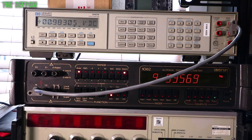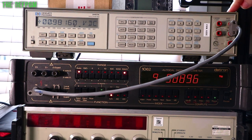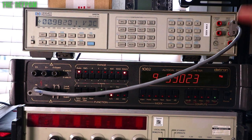and because they are a voltage divider and it's got a resistive element to them, the resistance on those boards in parallel with the resistance from the inputs on these changes the result. In order to get a known output, you need to know the input impedance of your meter. So if you calibrate that for this meter, it'll only work accurately in this meter. If you put it on this meter, it'll be slightly different because these aren't exactly the same.